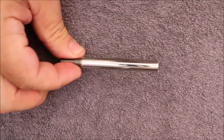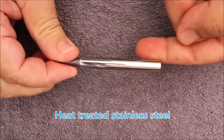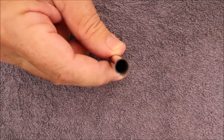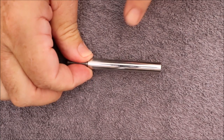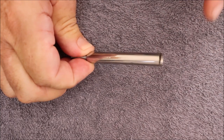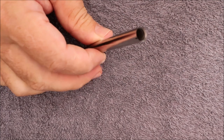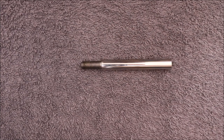So how it works is we have a tube — it was a solid bar that we've bored out. You can just see there it's hollow. The diameter is 10 millimeters and it's been bored out at 8 millimeters. That gives us a 1mm wall thickness. But this edge here is very sharp. This works like a cookie cutter, and inside there's a series of small grooves that help hold the sample. That's the basic tube in itself that has to be shot into the shark.